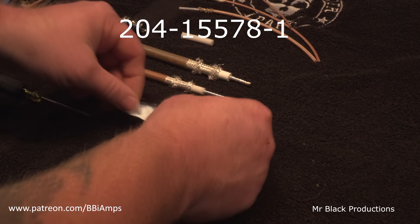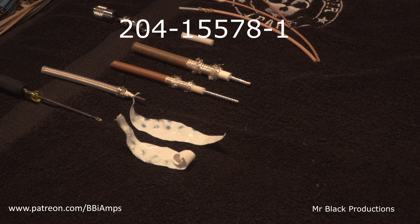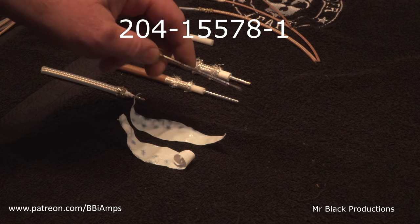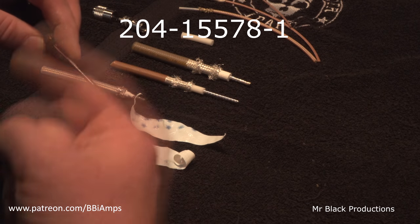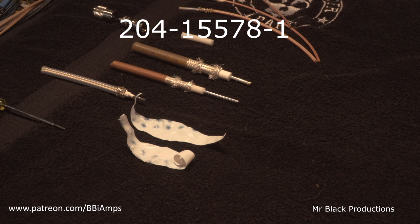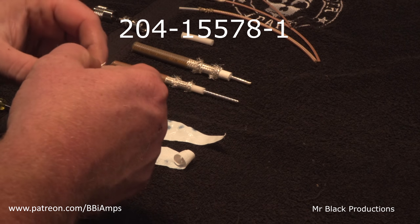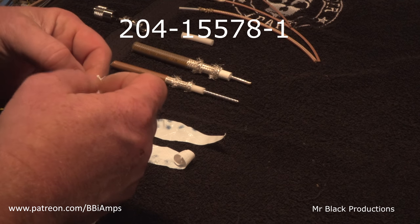What this is, is about 7,000 layers of wrapped PTFE tape. When you start to unspool it, it comes off in sheets. Imagine your plumber's tape that you use for water fittings — the end of a screwdriver is the center conductor. Then you take and wrap Teflon tape around that until you have the exact size you need for the outer jacket. That's what's going on here, but this tape is about three times the thickness of PTFE tape you can buy at Home Depot or Lowe's, and of a higher quality.